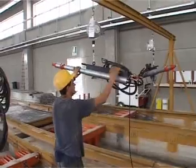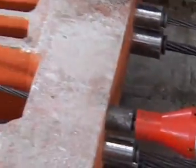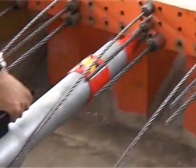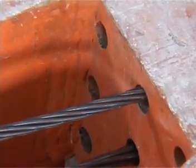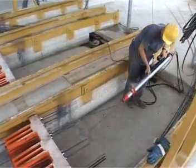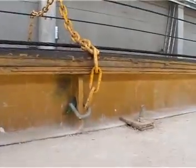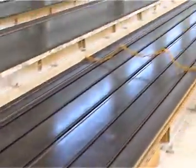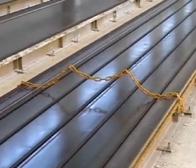Stressing. Depending on the type of cable to be tensioned, the operator selects a specific tensioning jack to tension the cables in a fast and efficient way. After the steel wire has been tensioned, the load is taken up by the reaction beams, which, depending on the element to be produced, can be designed to hold up to 400 tons for a 1 meter high element.